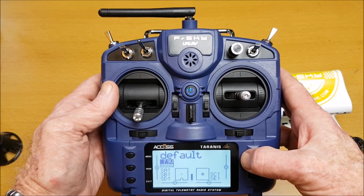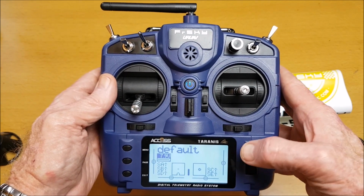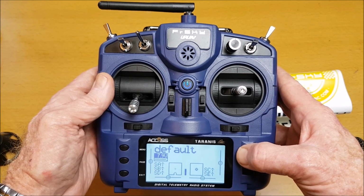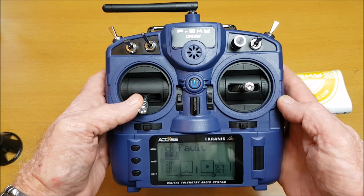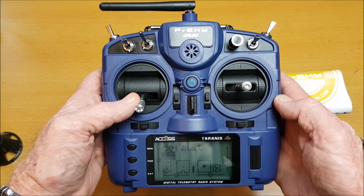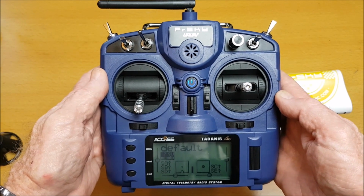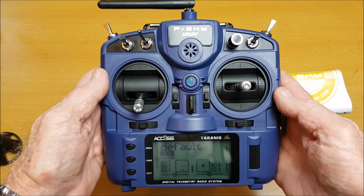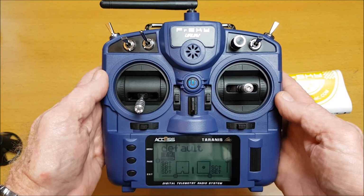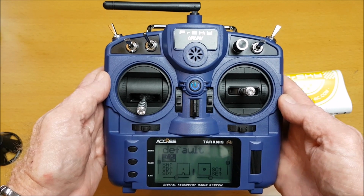And by default, this comes with the OpenTX system, but also comes with the new FrSky ETHOS system too. This also has 24 channels, a faster baud rate and lower latency with a high-speed module digital interface, and provides a more secure link between the remote controller and a model using a new different binding method.